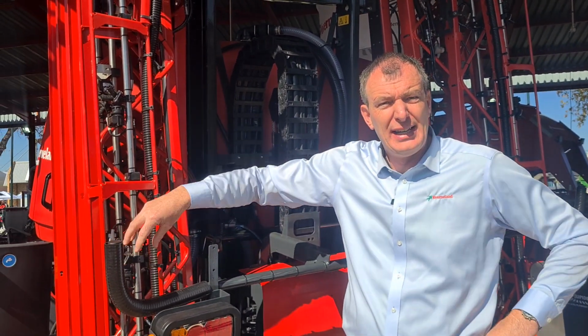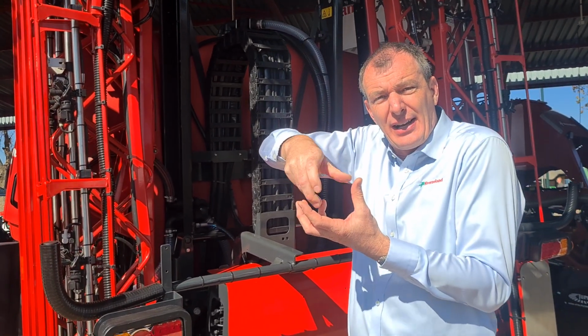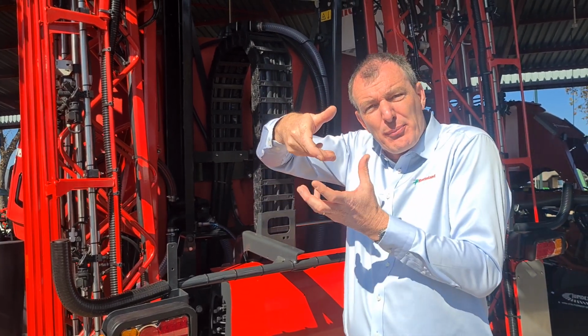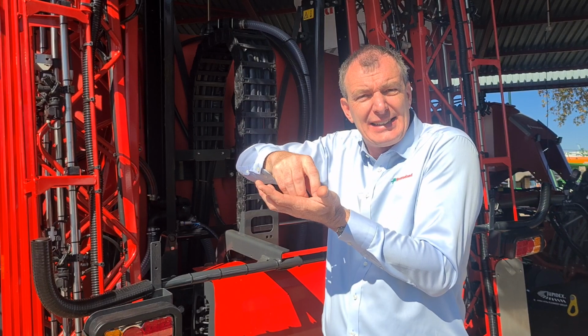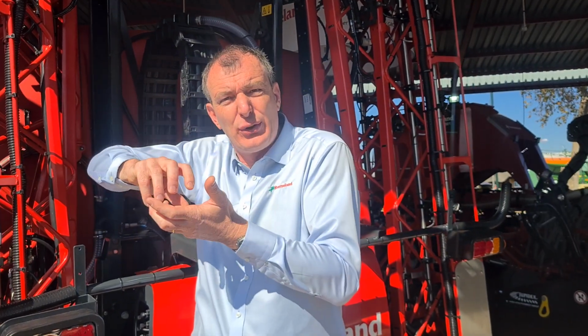It's proven really reliable. The valve itself is a stainless steel ball valve, just a motor opening and closing the valve, which is very basic. The ball valve on its sealing is cleaning itself, so it always works and always functions. And the power supply is rather low on this thing. The ones we've had not working were not broken, but overload protected. So if the turning gets too heavy, you take it off, open it, clean it, put it together, and it works again.